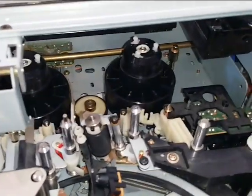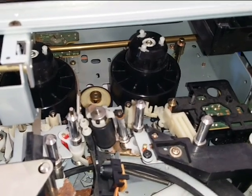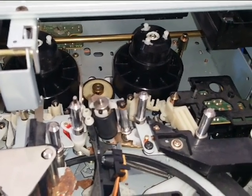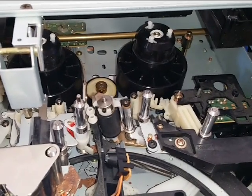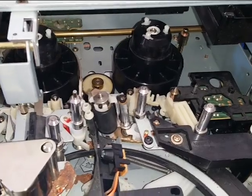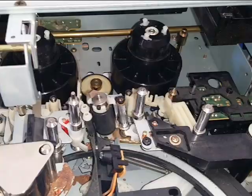Okay, if you look inside the machine, you'll see you got 2 spindles where the tape loads, and then you got a clutch tire in the center. Basically what that does is it flips from side to side for fast forward, play, or rewind. You need to put a new rubber tire on there. You need to pull those spindles out and re-lube them. Brand new grease. That will get all that freed up. That's a common thing you have to do.